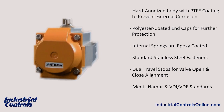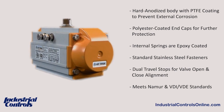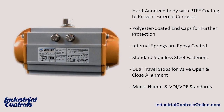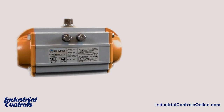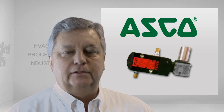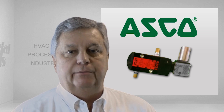Mounting dimensions meet all international standards. The solenoid connection and the accessory connections meet NEMA and VDI/VDE standards so any solenoid or limit switch assembly can direct connect to the actuator. We can provide either a weatherproof or explosion-proof enclosure. This unit is the weatherproof enclosure and it has a high-visibility beacon indicator for open and closed position. Our ASCO brand solenoid is also the best name in the industry for quality and reliability.